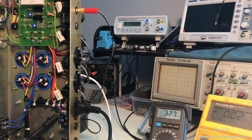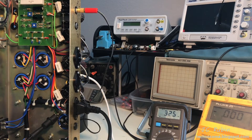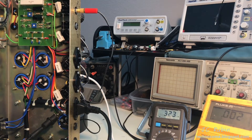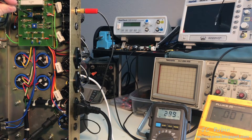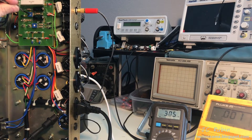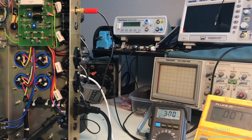Taking it out of standby - immediately we can see current flowing at 32.5mA. I'll leave that alone for now for the purpose of testing - it's nothing crazy. I'm going to make sure the sweep of the pot is good, just moving it back and forth a little bit. Deflection looks nice - sometimes they get gummed up a bit. I'll leave it at 30mA right now, something conservative.